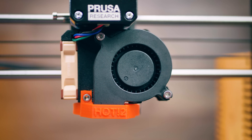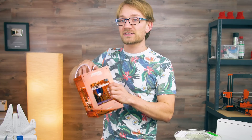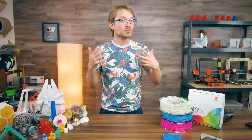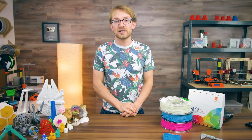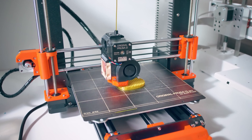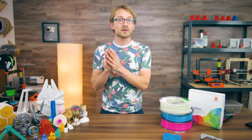That low-temperature property is also what practically requires you to use a part cooling fan when printing it to get crispy and clean prints. There's a visible difference between an okay fan setup and a really good one that gets cool air onto your freshly printed layers from every side. It's pretty hard to get too much cooling onto your PLA prints short of using an air compressor and blowing the prints straight off your bed. With enough cooling, it's possible to print PLA at pretty mind-boggling speeds by slightly increasing the hotend temperature or using a high-flow hotend like the E3D Volcano, but typically your 3D printer's mechanics are going to run into issues like ringing and step loss before you get limited by the melt rate of PLA.